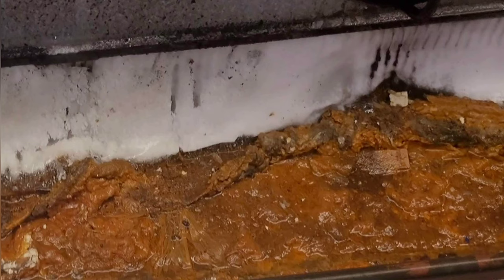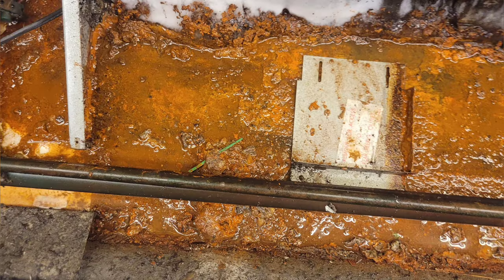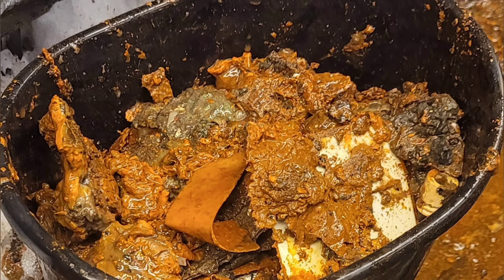On this job, I had a beer aisle. It was a whole aisle that had froze up and it was not cooling. Hadn't been cooling for a while. Had to be cleaned and turned out to have a bad fan motor, but for the most part just needed to be cleaned.